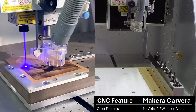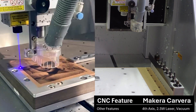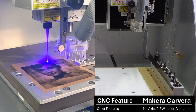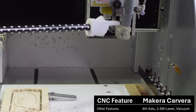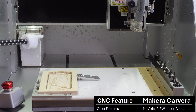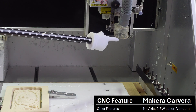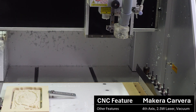One caveat is that it's pretty smoky — anytime you're using a laser you're burning stuff, and anytime you're burning stuff you're creating smoke. But if you're doing some combined CNC and lasering, this machine is extremely capable. It also has a built-in vacuum. That's what this little dust collector is here. It stores about a liter of vacuumed waste, which is enough for most cuts but usually has to be emptied after each cut. The dust shoe does a great job collecting the vacuum and keeps the area pretty clean.